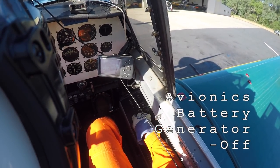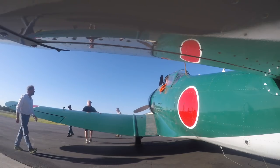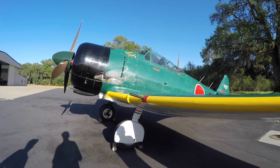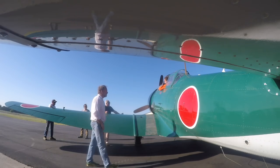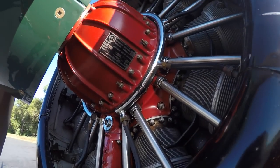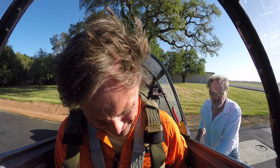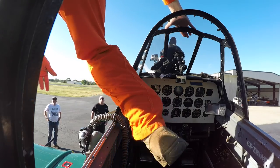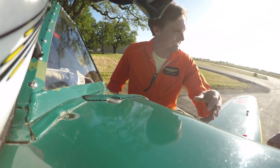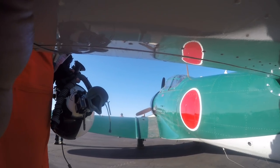And he happened not only to be on the ground during the flight, but now he's available to look the thing over. So he climbed up on the wing and started checking the hydraulic cylinders that are right behind sort of your left arm or elbow in the pilot seat of the T6G. Checked the reservoir, made sure it had fluid in it, made sure there wasn't a big pile of fluid somewhere or something obviously broken. And the story of this anomaly in big pictures, there wasn't much to find. Everything looked normal and we were never able to recreate the problem on the ground.